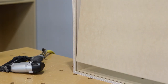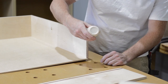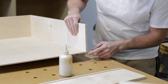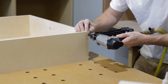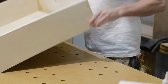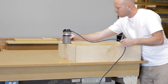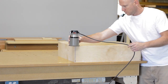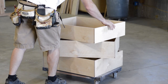One-quarter inch thick MDF slides into the groove nicely, and it helps square up the drawer box as well. I'm using one-inch long 18-gauge brads to hold these together. Small round over on all the top edges, and completed drawer boxes are stacked neatly.